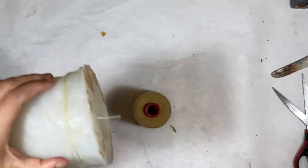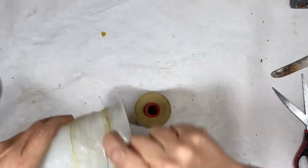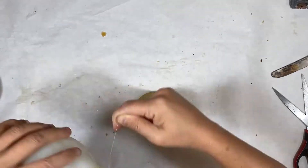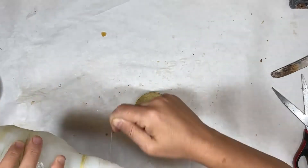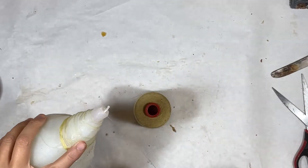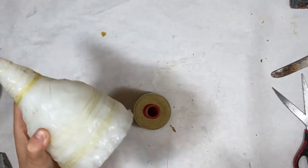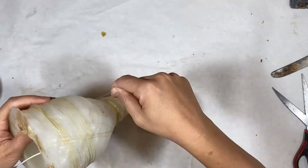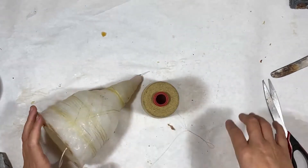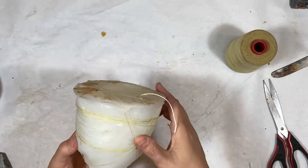To bind a silicone mold at the seam, I grab a spool of thread and close the seam really tightly with my left hand, then pull taut on that string and wrap it around the mold quite a bit. Sometimes it can feel pretty odd if you have a funny shaped mold — you just keep working it until you get that whole seam really tight. You can take the string and wrap it across the top of the hole. I don't tie the string when I'm done and cut it; I just use my thumb and rub a knot into it essentially.